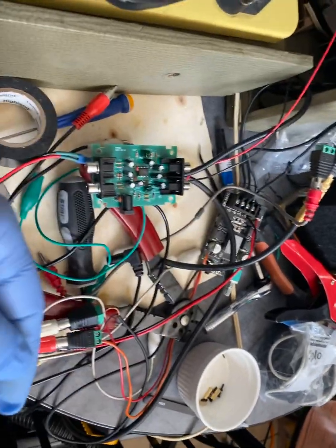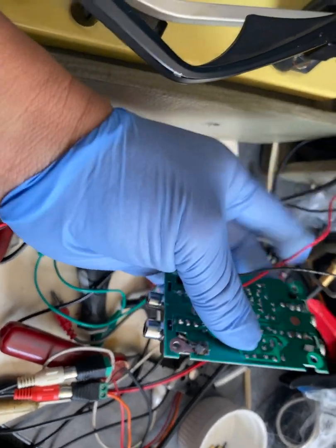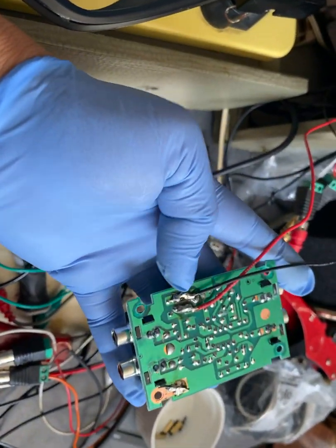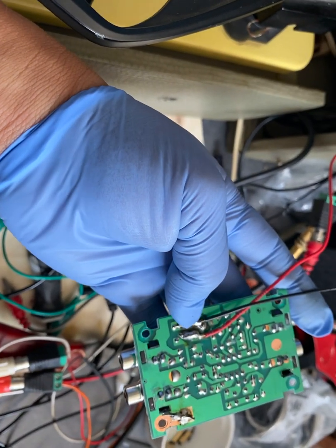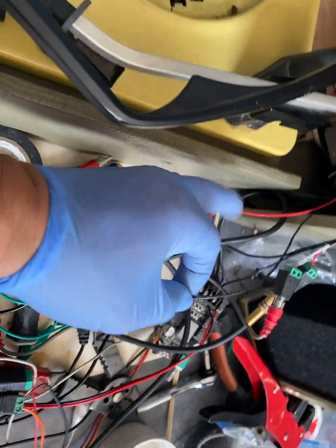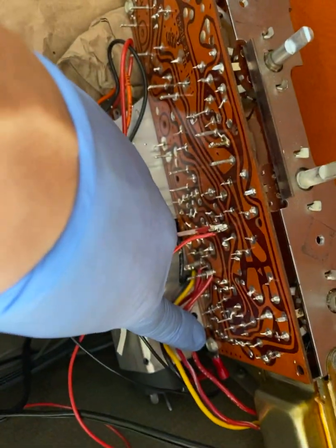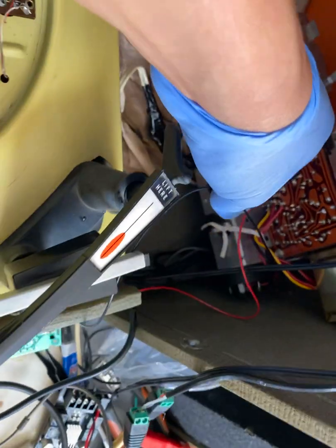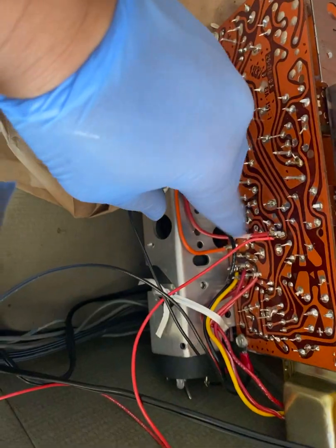So that's that. Now, to power this thing up, you need somewhere between 12 volts to 15 volts. And I started these 2 wires, black meaning ground and red meaning 12 to 15 volts. So let's follow the black. The black goes to that bolt there with that red connector. And then the red, which is carrying the 12 to 15 volts, is coming out of here. This thing's producing like 13-something volts. So that's enough to power that up.